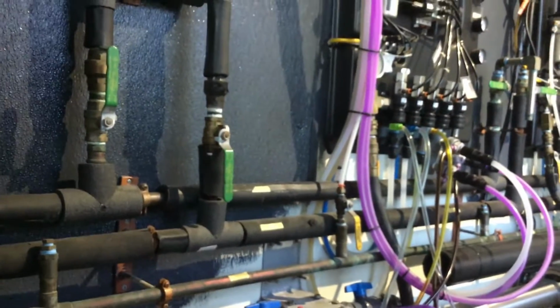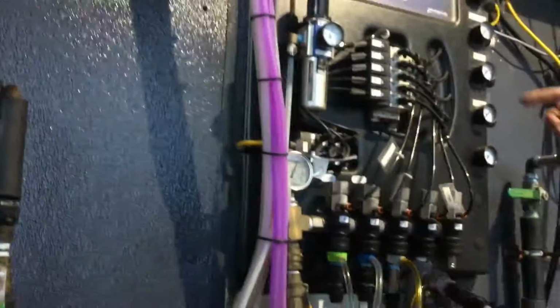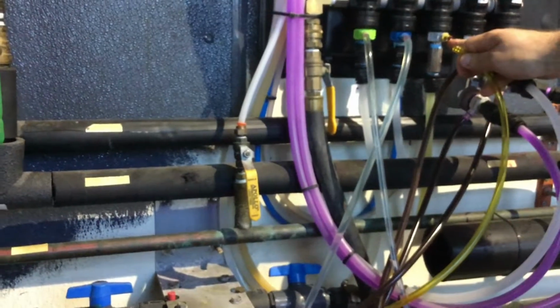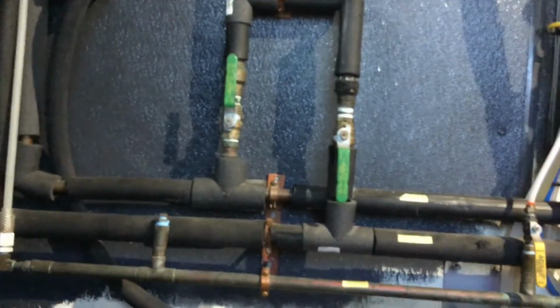They call this a hydroflex unit. You've got high pressure water pumps that come in, filtered, and then when everything is demanded, let's say Rain-X, it shoots high pressure water through this manifold and sucks the chemical through here, and there's a tip that changes the ratio of water to chemical. Obviously, they're super concentrated, smaller chemicals that come in boxes now instead of huge, heavy barrels, which is really nice. Easy to deal with. The backaches alone from flipping those barrels around. I'm sure they've had customers for decades say, can't you do it different?